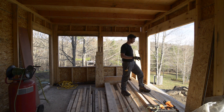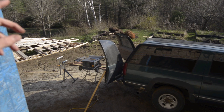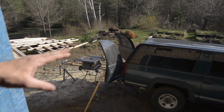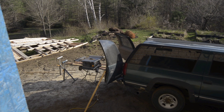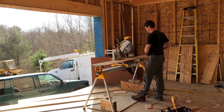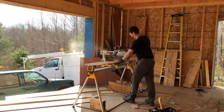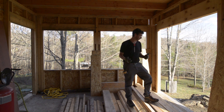What I'm going to do is basically nail them in the openings. I've already pulled the plywood out of the truck and ripped it to width. Set your table saw up right behind the truck where you have the plywood, pull it right out, and run it right through the table saw to rip it down to width. I did all of the pieces for all of the openings, brought all the pieces up, cut each piece on my chop saw keeping everything nice and square, and now I'm ready to nail these in.